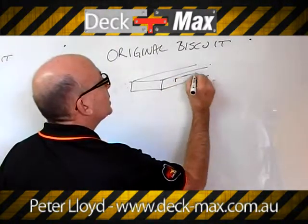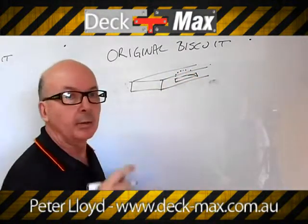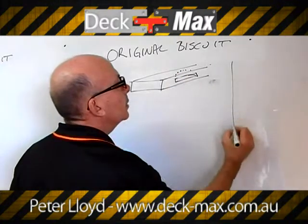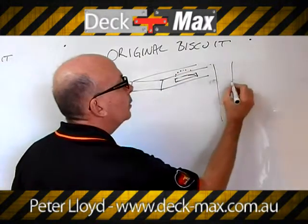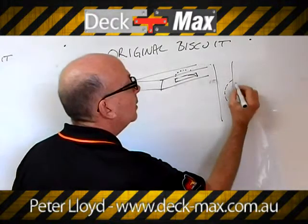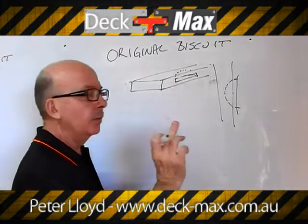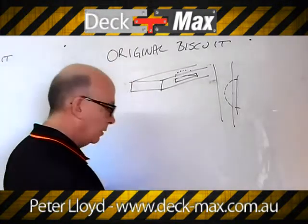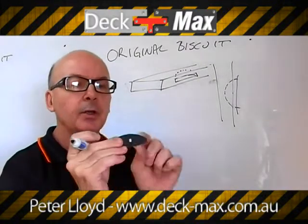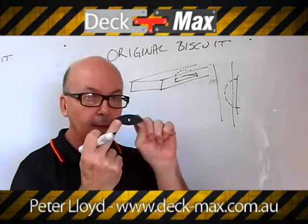It will leave a cut in the side of the board with a half-moon shape, depending on how deep you've cut it. If I was looking at the board from the top view, how deep I cut it from here to here also varies how wide the cut is at the front, because the blade is actually 100mm. But the biscuit itself is actually different to that specification, except for the arc — it suits a 100mm blade.